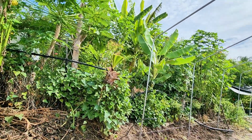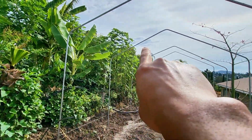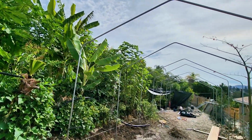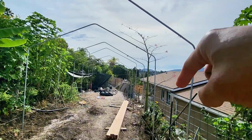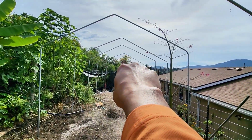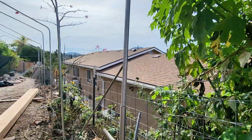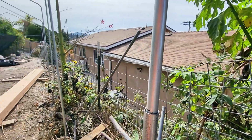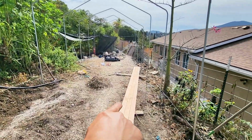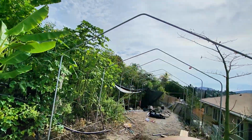First, what we're gonna do is we gotta get this end piece leveled on both sides. Same thing with the end piece over there, and find the height that we want on both ends. That's all we got to do, and then we'll run a string line through this line all the way over there, and we just got to match all those lines up, and we'll lock it in place with a self-tapping screw right here, and we're good to go. And then we'll run these boards on one part right here and one right in the middle.